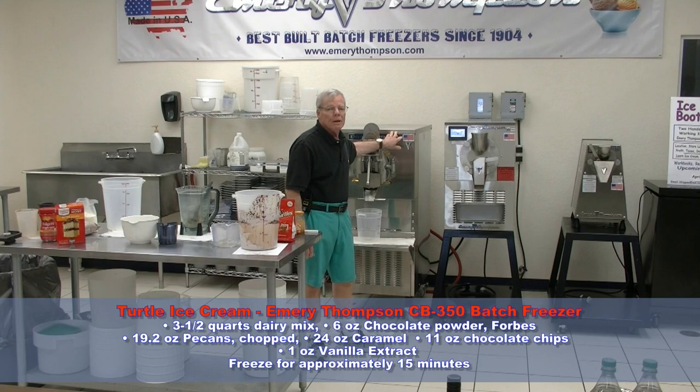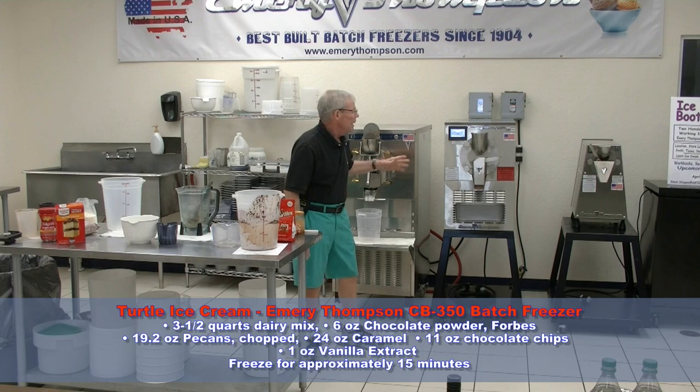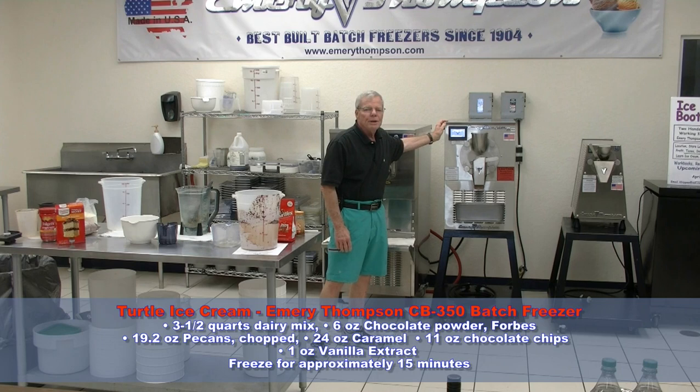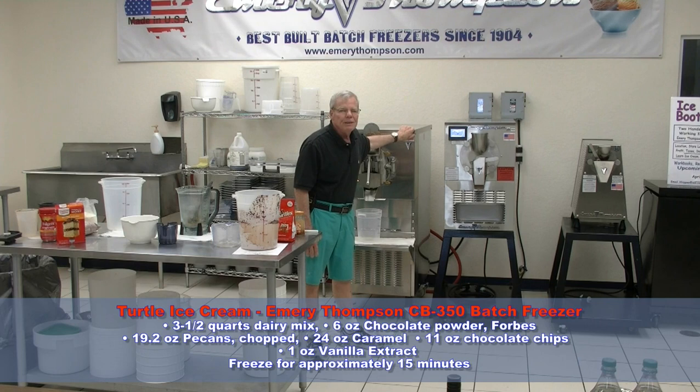So when you are doing a new store, I'm going to talk to your electrician. We're going to get his name and talk to him on the phone, and we're going to say, I know you don't see my rationale yet, but instead of running this wire as a certain thickness, we want you to run a heavier wire to run this machine. The numbers are actually, this is a 12 wire, and we're going to go down to an 8 with this. The reason is we know someday you're going to buy this.